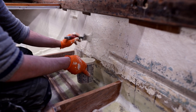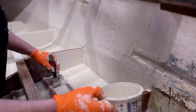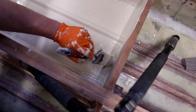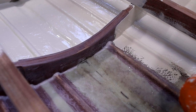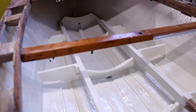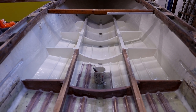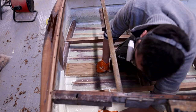One of the first jobs when the boat was turned over was to paint the inside, freshen all that up and make sure everything's nicely coated and properly sealed — which it pretty much already is because we've epoxy coated everything to begin with and keyed up most of the stuff before we put it in the boat. So this painting stage was pretty much ready to go straight away. A little bit of thinking ahead makes things much easier. The paint I'm using is a product by Jotun called Pengard Top Coat — it's a really nice paint for bilge stuff.